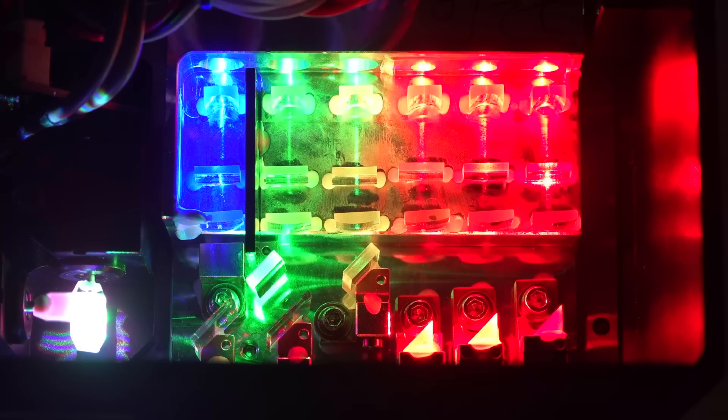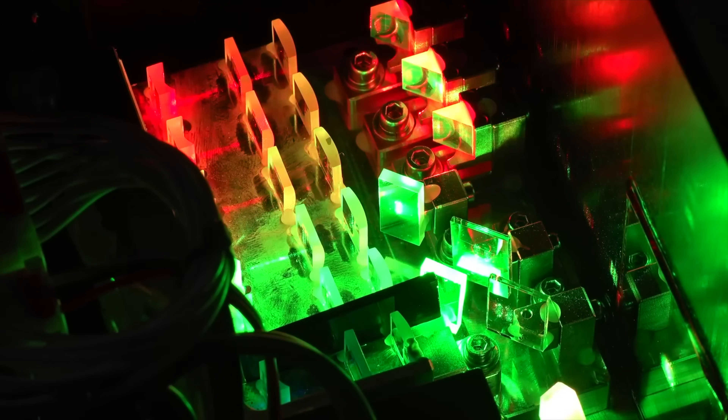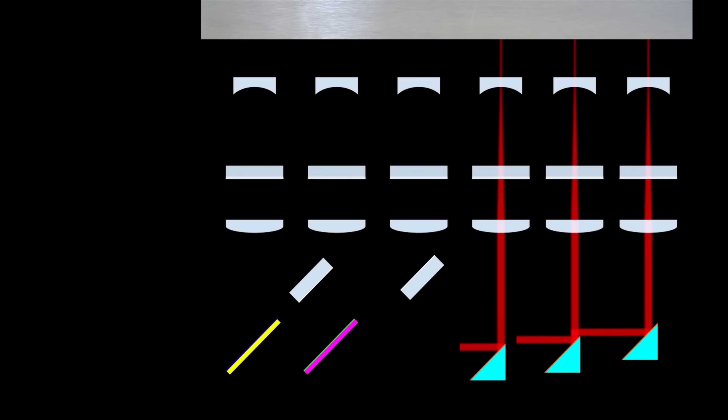The LaserCube model shown here has a single powerful blue laser, two greens, and three reds. When it is energized, we can see the array of mirrors and lenses that are used to focus and direct the beams. There's a lot of beam spread straight out of a laser diode, much more pronounced in one axis known as the fast axis, and a bit less on the slow axis. To correct this, each beam is first sent through a lens to gather that sprouting light back into a focused beam on the fast axis, then a second lens to do the same for the slow axis. A third lens collimates the beams into a straight, coherent beam.